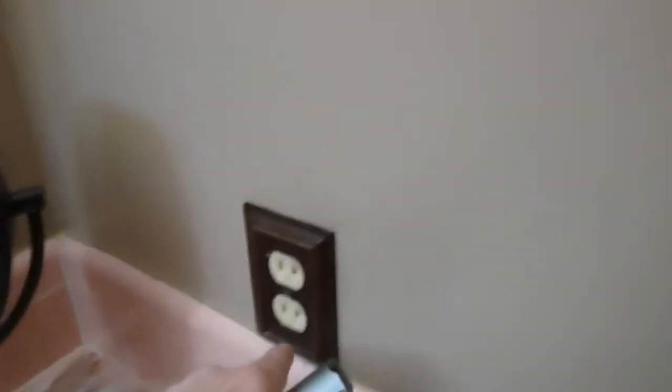This is the first bedroom — west bedroom. You shouldn't have pull strings and bare light bulbs in closed closets. In 1954, sure — moving on along, same story. In 1954 construction, we don't have any grounding. Even if you had GFCI, you're supposed to have both GFCI and grounding — not one or the other — and I don't think you have GFCI either.